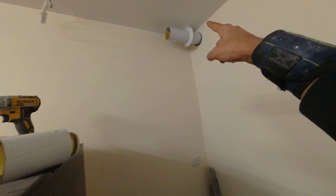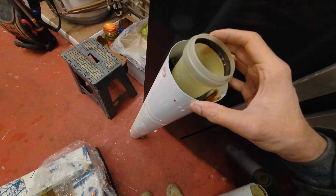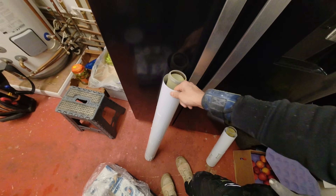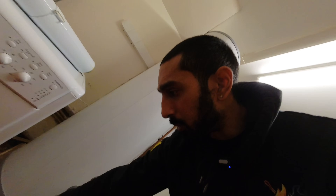So I end up taking apart all of it anyway. There's no rusting on that short section, no rusting on this piece, no rusting on this section either. However, the rusting is starting from this one here — you can see underneath there. But I can't see any signs of where it would have been leaking from; there's no split in the flue itself. I think it must have just been a dislodged flue seal. The rust hasn't gone completely through the flue — testing it with my screwdriver, it's not going to pierce it.